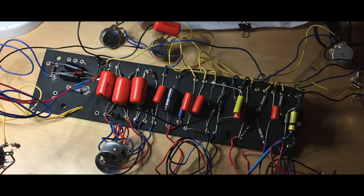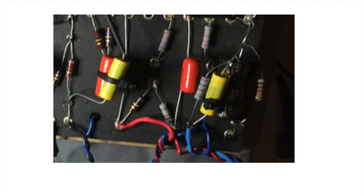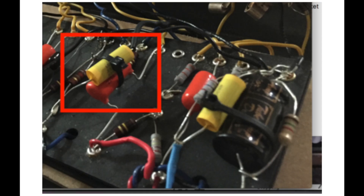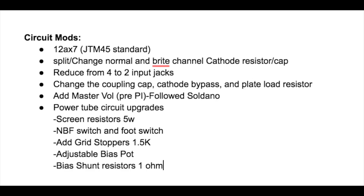This is my uninstalled final board where I have done the modifications we spoke of. I also added another bypass cap in the second stage, basically as a gain mod — a 0.68 microfarad bypass cap on the second stage; it's a nice little gain mod and I've actually left it on there as permanent. Now I mentioned the Marshall mods, but here's a full list of all the circuit mods I did aside from those. Really, maybe the greatest has to do with the negative feedback, and of course putting in an adjustable bias. I highly suggest you read through Rob's page on modifying the Bassman. Feel free to reach out if you have any questions — I would gladly like to share.